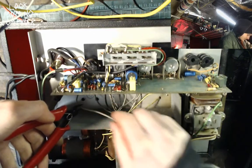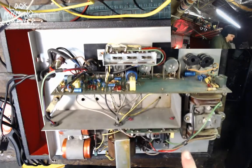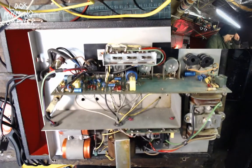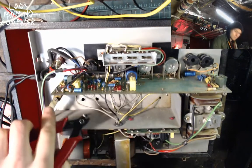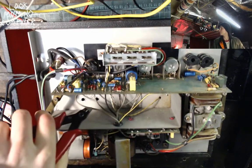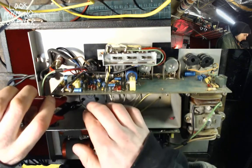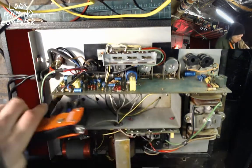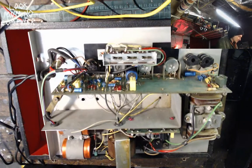I just don't want to... It's quite close as it is. They're really close. I mean, they're already really close to the power supply coming out of it into there. Wow, I didn't realise that. That's quite crazy. What I'm actually gonna do is unsolder this and add some because this needs to be shielded. So I'm just gonna snip it, and the worst that happens is I'll have to replace the wire if I can't actually get in there to get the shielding off. Let's see what happens. Nope. I just cut the end of it off.